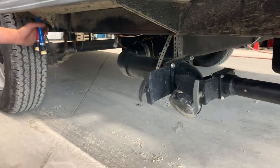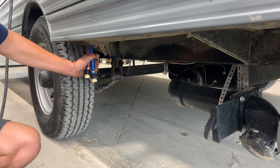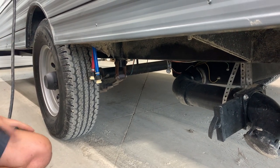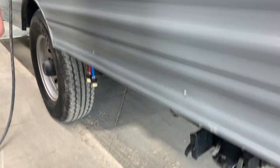You do have two low point drains just right here. If you want to empty the lines because you're leaving the unit for a while and you don't want the water going stale or stagnant, you can just loosen off those caps and take them out — it's going to drain all the water that's inside the lines. It also helps if you're ever changing a faucet, as there's a lot less water draining all over the place.